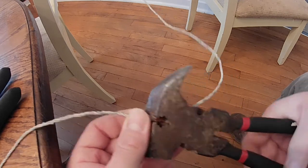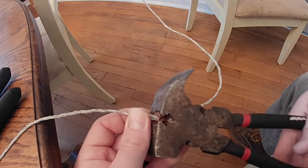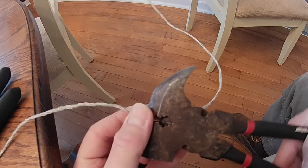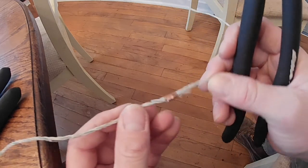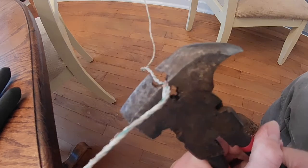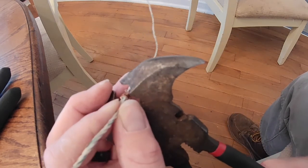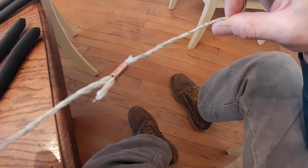You want to be kind of easy with it, because that copper splice will — you can tear it with the pliers. Just get it as flat as you can. That way it'll go through your wire guides or any of that. But you also have a clean splice. Hope that helps you guys.